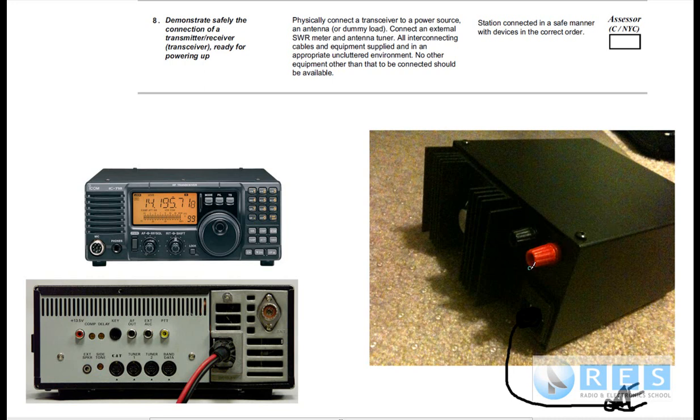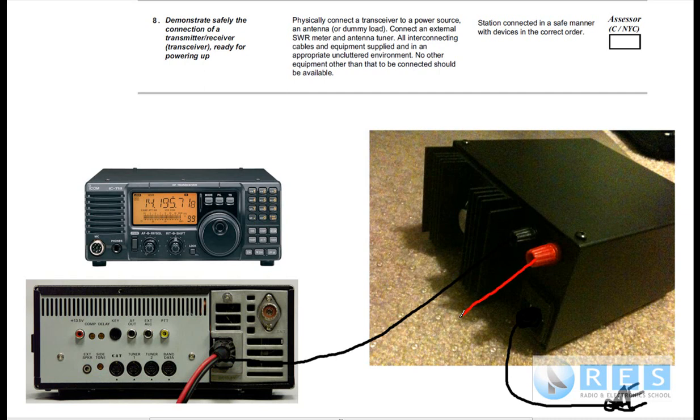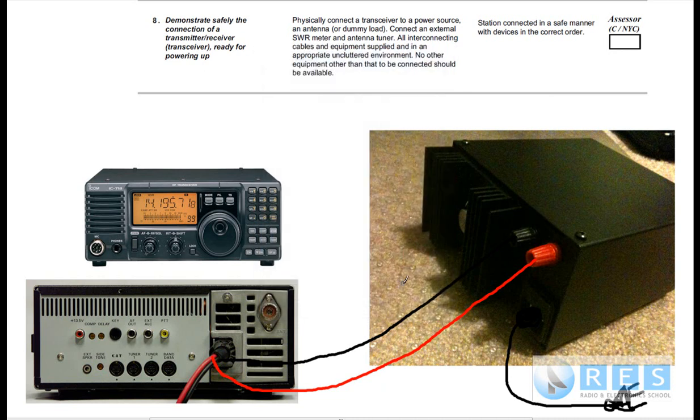So you've just plugged that into the power point, you would connect the black lead to the black lead on the radio. I'm just going to change colours, need a red one. And you connect the red lead to the red lead on the transceiver as well. Changing colours again, forgive me, just easier for you. And then you would connect an RF patch lead. You haven't turned anything on yet. You would connect an RF patch lead to the RF output of the transmitter, and you would connect in there